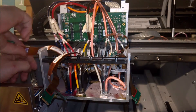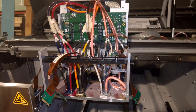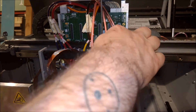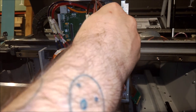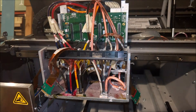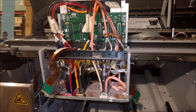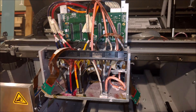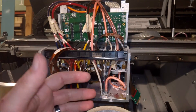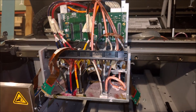After that, you'll want to take out the actual print heads themselves. Get your allen wrench — I have my long one. If you have a short one it's no big deal, but it's a whole lot easier with a longer one to get the back side. You'll just unscrew, and again keep track of your screws. I normally set down a piece of masking tape and set them inside there — keeps them centralized and organized.